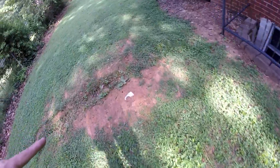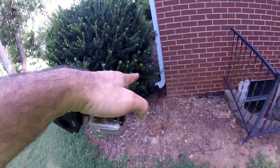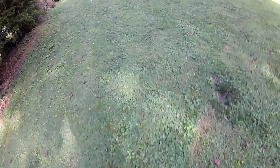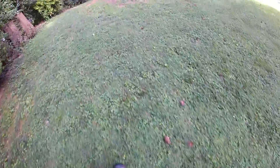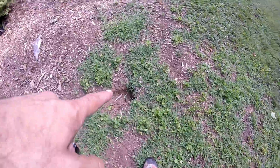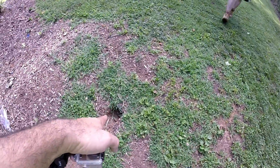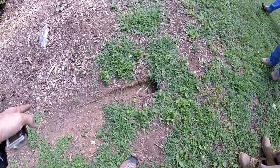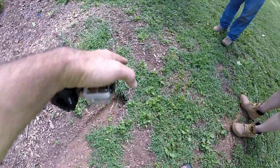Catch this gutter here, come out across, and catch this gutter — again, there's already a system in here but the system has failed. And then we're going to take it out here to where this pipe is right here. He ran the water in the gutter for probably 15 minutes before we got a little tiny barely trickle coming out of it. So here's where we're going to dig a hole on the end here and fill it with riprap.